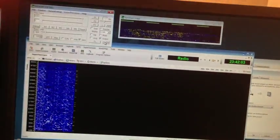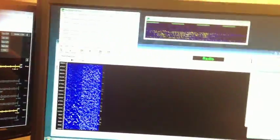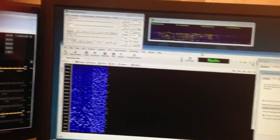I'm going to turn this software off here, so now it's not filtering the audio, and I can enable the 'listen to this device' option in Windows so you can hear what it sounds like. Unlike the software that normally only lets you hear 3 or 4 kHz of audio, this will let you hear about 40 kHz.